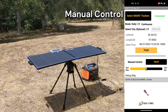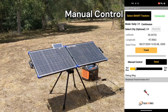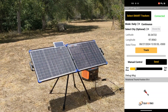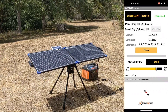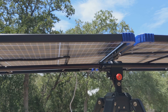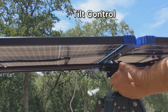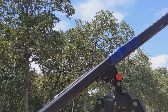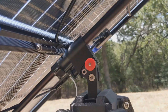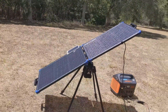The phone app also allows manual positioning of the solar panel. A slide bar can be used to position the panel anywhere between its sunrise and sunset positions. For optimal solar energy capture, the system also supports a tilt function. Simply pull on the tilt red plunger while supporting the carriage. Release the plunger and a click will confirm when it's locked in position. This allows tracking with a southern or northern tilt depending on your hemisphere.